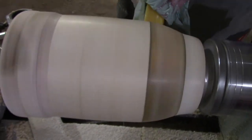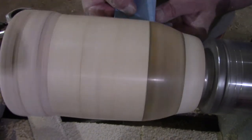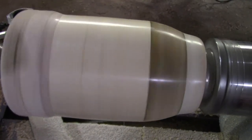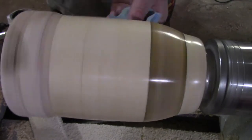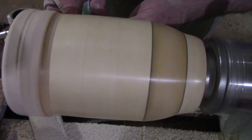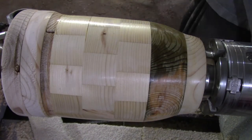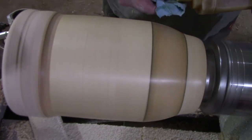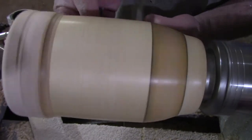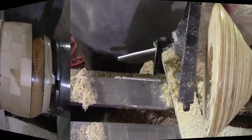Here I'm putting beeswax on to seal it, adding some and pushing it around. And now I add some linseed oil. To help that linseed oil dry, I did add a coat of shine juice, which is shellac and alcohol in linseed oil. The alcohol helps to dry it up, and I did use a little friction there.